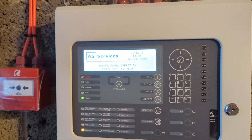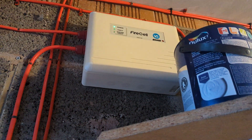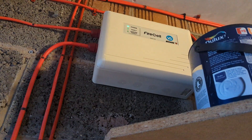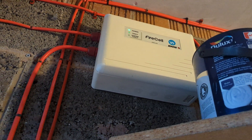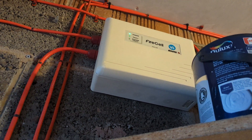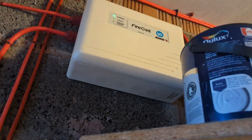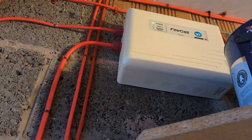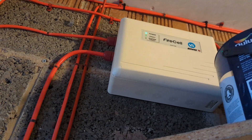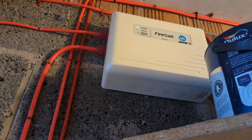The two main panels for the house are networked together. I've changed that for a fire cell hub, so I'm using EMS fire cell devices now. Instead of the fire point — it was getting a bit old and I thought an upgrade was due. There was nothing wrong with it in terms of working, but running a panel basically just for sounders was a bit ridiculous. This works a lot better and has better power consumption since it's just powered by the loop.